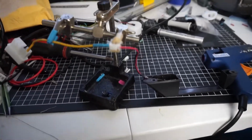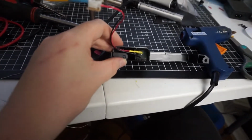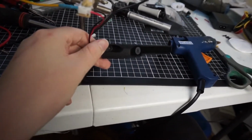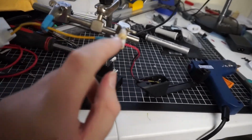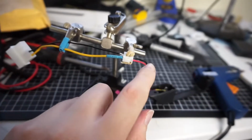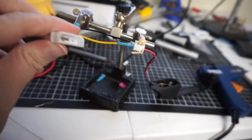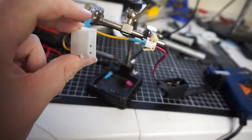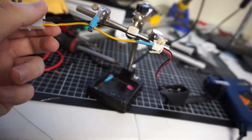So here is the finished item. There's the LED down in there. I blacked out some of the letters behind it so it didn't bleed so much. Then we got this JST connector here. And then the positive side goes to here, to the 5 volt side of this connector. This was a leftover connector from another video I did, so go back and check that out.